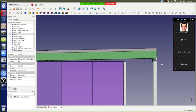And even though the outer plywood is like 5/8 of an inch, over 100 feet, that adds up. Say it's only 5/8 inch for the exterior plywood, that's 100 feet of it. Well, how thick does it become if you compress it over 1 foot? So think about a piece of 100 inches of thickness of wood holding that roof. You know, just hand-waving order of magnitude considerations. If you had a 2 by 100, yeah, that would hold it, of course. So you have to think that, oh yeah, all this plywood, even though it's thin, over 100 feet, it adds up to a lot of strength.